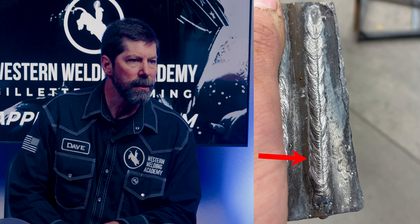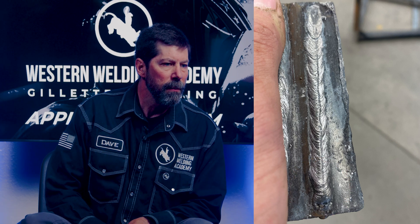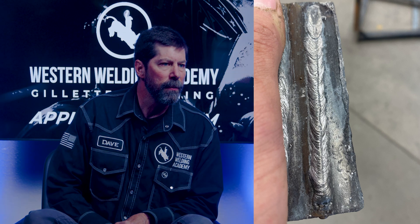So now we're looking at Bryce. Bryce is 16 and he's doing stick welding vertical up with 7018. You seem to be having some issues with a little bit of undercut on the side there. Is that a crack right down the middle that I'm looking at? You seem to be struggling with staying consistent with your movement. I see some bigger steps at certain parts and other parts are looking kind of steady. Maintain that consistent speed as you go through it. Watch that long arcing at the beginning — looks like you got some porosity at the beginning. Might have been startled by your stick arcing up at the very beginning there. Remember, calm down, move slow, stay with it. I like how you are progressing with not going too fast. All your dimes are not spread apart too far except for certain parts, so you're just not being real consistent in everything you're doing.